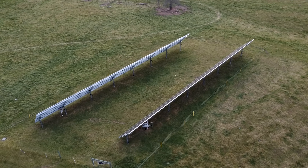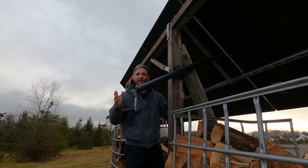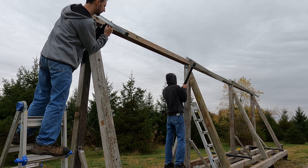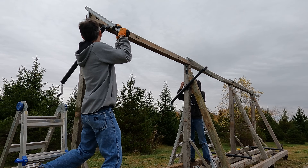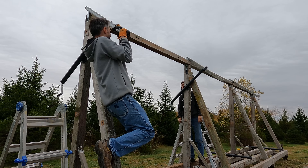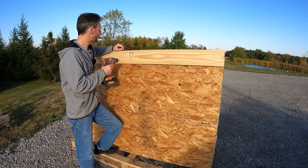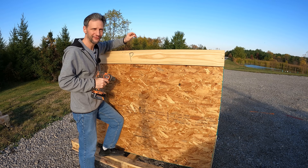I asked Sinclair if they would support me for this build with a few jacks. They were happy to do so and said they have so many requests that they plan to start selling them on the DIY market — when they become available, I'll link to them in the description. One jack could lift this whole array, but my unistrut purlins aren't strong enough for that span, so I'm using four jacks mainly to support the unistrut. Attaching the inch-and-five-eighths unistrut purlins was pretty easy once all the jacks and support braces were mounted. These guys from Solar Clearout make a nice crate — I'm really curious to see what these dent and scratch panels look like.